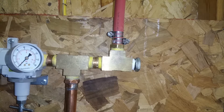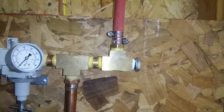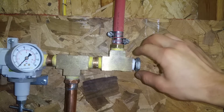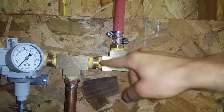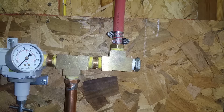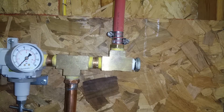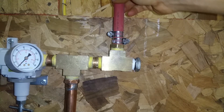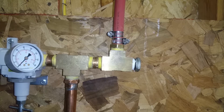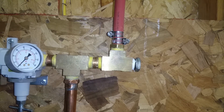I got this thing hooked up now. I got it double clamped — I didn't crank them down too much because I didn't want it to eat into the hose — and I got this plugged right here with a quarter-inch plug. I like to use white Teflon tape; you can see the existing stuff is yellow, and this is white because it's way cheaper, like half the price. It's all plugged and working great. When I put it on the hose barb I gave it a little bit of slack so that it wasn't tight.